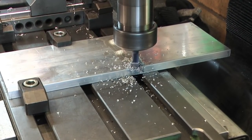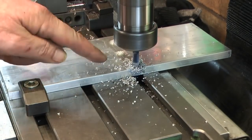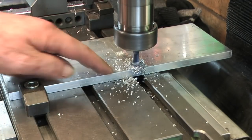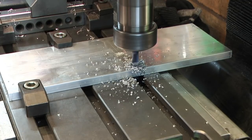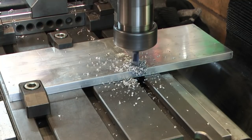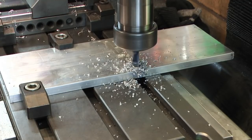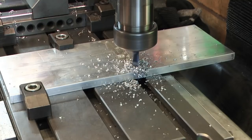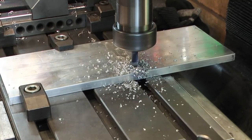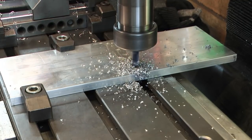I'm basically using an 8mm cutter to chop the end off this bit of plate - this is the bit I'm going to want. I'll machine that side - I've squared it up on the table, got it clamped down direct on the bed. I'm being very careful that I'm in the slot with the cutter before I even start it, so as not to mill a slot in my table. A 2mm cut - it's 10mm plate I think, so five passes. I'll chuck a bit of WD-40 in there and let it do its thing.